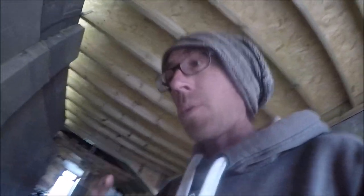So this stuff's pretty mental. You have to get the temperature up pretty high in the metal. I didn't have the torch up enough to start with, and also I had it on a metal surface, like thick solid steel, and I think the heat was just leaching through. So putting it on bricks has really worked really well.